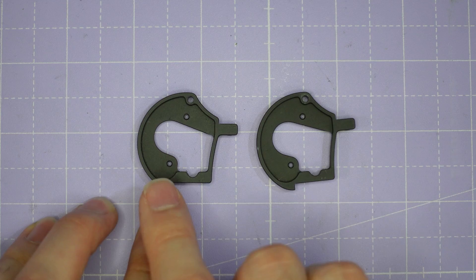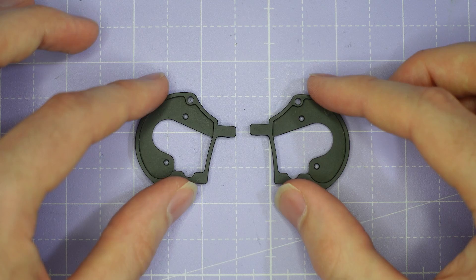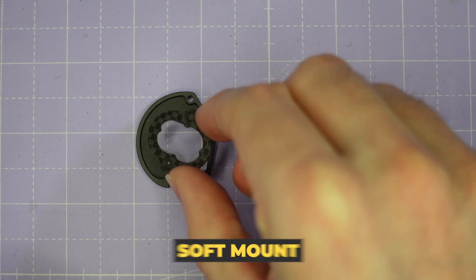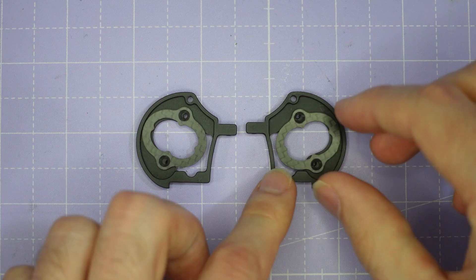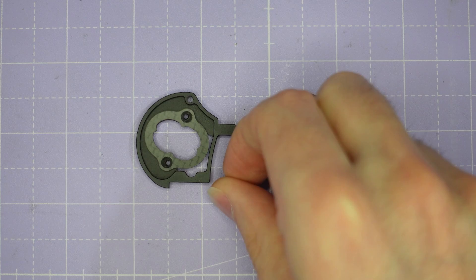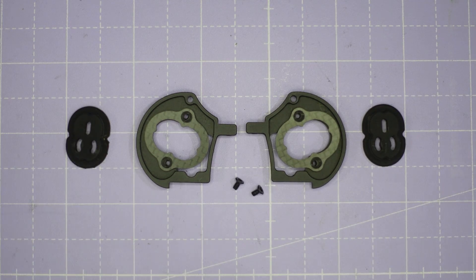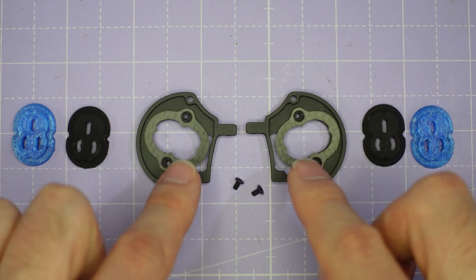We're going to start by putting together the camera cage. Both camera cage parts are identical, but it helps when building to set them up back to back so you make sure the plates are attached to the right side. There are loads of different options for how to assemble this camera cage. If you're assembling it for a soft mount — for example for the DJI O3 system — you're going to put the two soft mount plates into the cage with the countersink facing upwards, then screw those camera plates into the cage using short M2 by 4mm countersunk screws. Then you can use the provided silicone gummies or 3D print a slightly firmer TPU gummy to mount your camera into the cage.